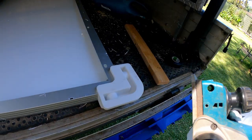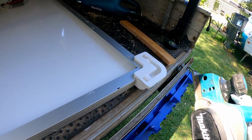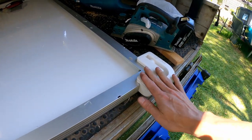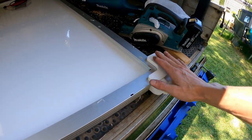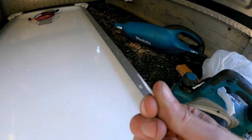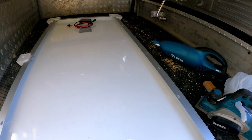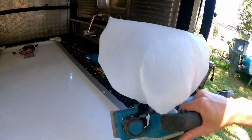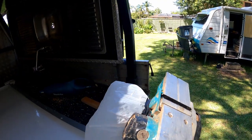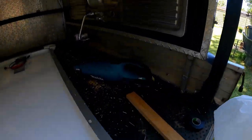I'm going to use a planer with some brand new blades — that's the best way to cut this hard plastic with the tools I have without burning it. Using a grinder would burn the plastic; this takes off very fine shavings. It's going to go everywhere, so I've put a little dust extraction bag on my planer so I don't have to vacuum it all up later.